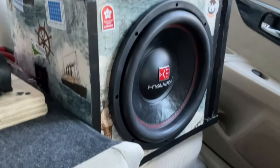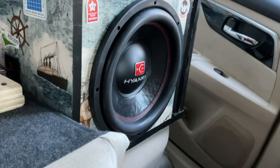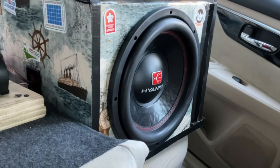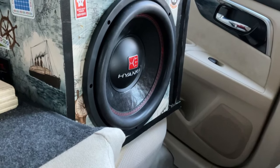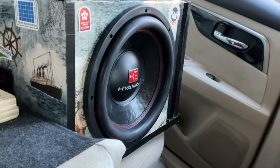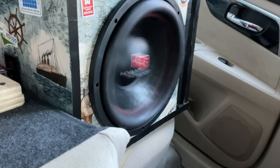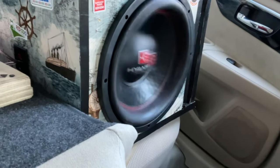That was the music test. As you can see, we were peaking up to about 500 to 700 watts. When I hit 700 watts it did start stinking a little bit, because it is only a 250-watt RMS sub. Next we're going to do an excursion test — I want to see how this thing handles low excursions. I'm going to push it until it bottoms out, then back off one volume so you can see the excursion.